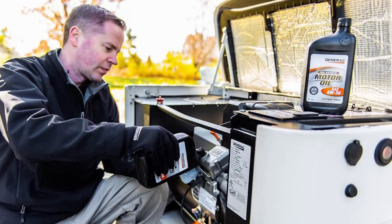Nice. And let's talk about maintenance on this generator. So let's say you've got this whole home generator. What does the maintenance look like? We typically install the Generac generators, and their maintenance program is just oil changes, filters, batteries, and then it's got its own onboard diagnostics. So it'll start up and run every week just to function test, and then it may throw an error code. It'll alert you on your phone, and then you'd have to schedule maintenance for something else.